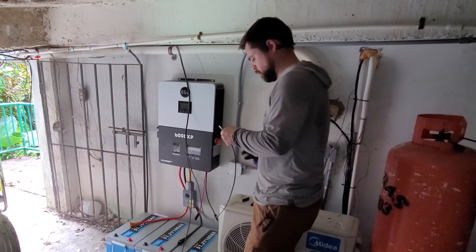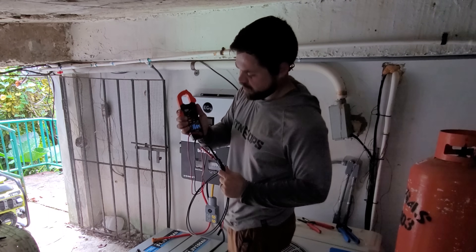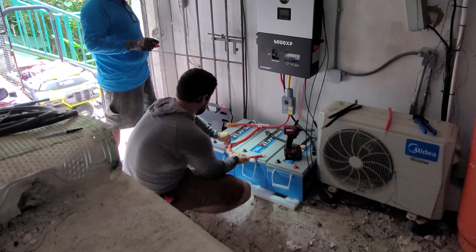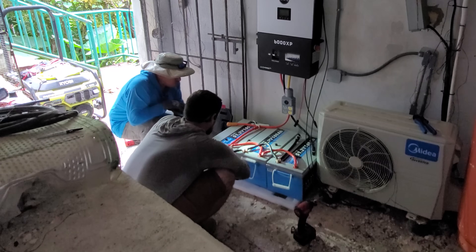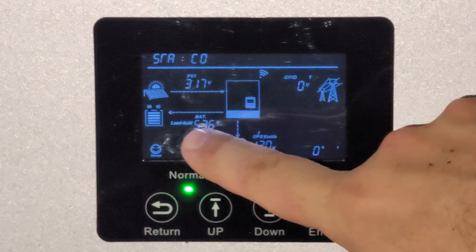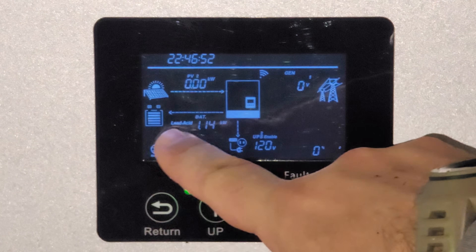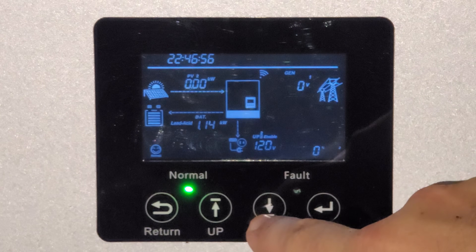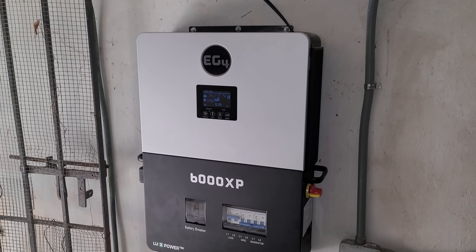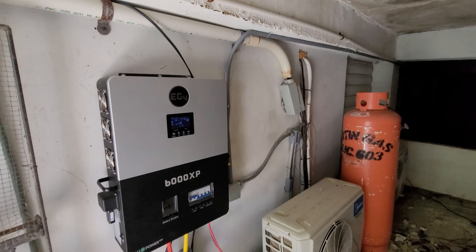It's pretty easy to find an MC4 connector kit on Amazon, though you won't find it in local hardware stores. Double-checking our voltage, we're getting 368 volts, which is exactly what we want from those 10 solar panels in series. To connect the batteries in parallel, we go positive to positive to positive, then negative to negative to negative — not positive to negative, which would be series. Because this is a small system, we're not concerned about battery balancing, so no balancer is needed. The batteries are near full at 53.6 volts each, and we're getting about 313 volts from solar, meaning 1.15 kilowatts is flowing from solar into the batteries. We run this in lead-acid mode since there's no communication between the batteries and the inverter. And just like that, in less than two days, we installed this entire off-grid system.